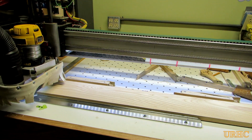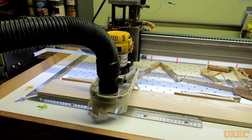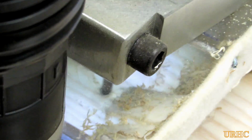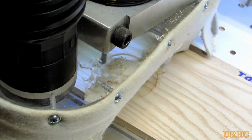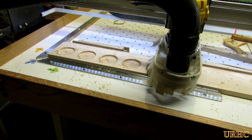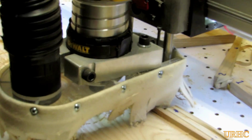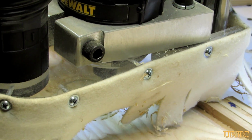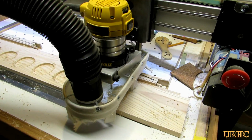Then, after cutting the parts, I needed a way to keep the jars from moving around and falling out when you pulled this rack in and out. So what I decided to do was go over to the CNC router and program up some pockets that each of the jars would fit into. Now I decided to use some of those Ball quilted jelly jars, the 8-ounce and 12-ounce sizes, because that's basically the perfect size for the little plastic containers that we get from our Amish store.